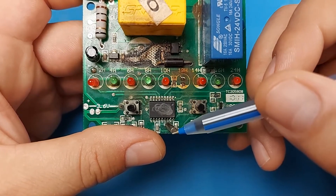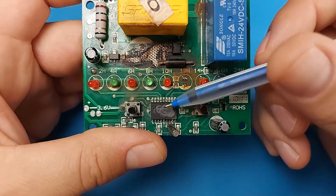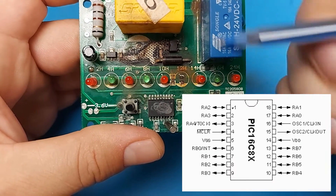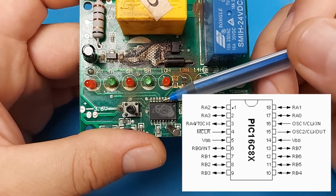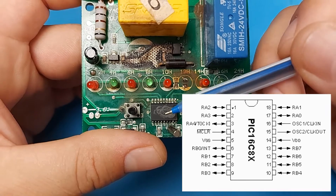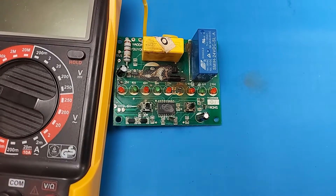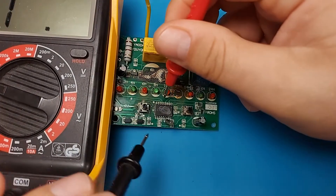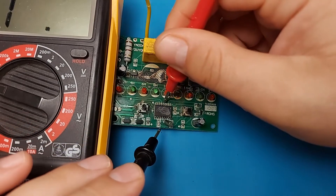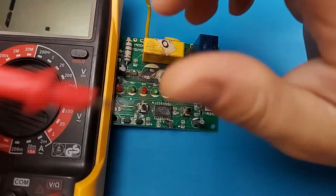Based on the oscillator attached here, this is probably a PIC microcontroller — I'll add that guess here, it might be completely wrong, but that's what it looks like. If we measure between VCC and ground on the microcontroller it's a dead short, which means high enough voltage went through the microcontroller and basically destroyed it. On continuity mode you can check that — that's a dead short on the microcontroller.